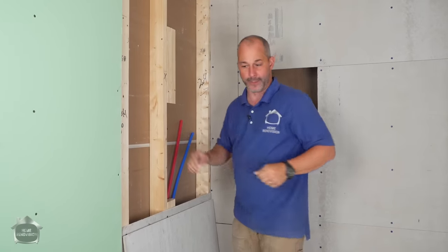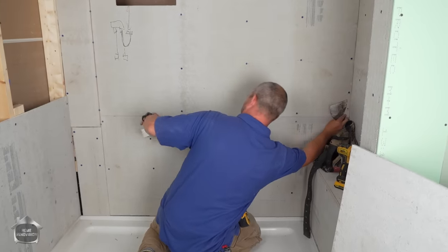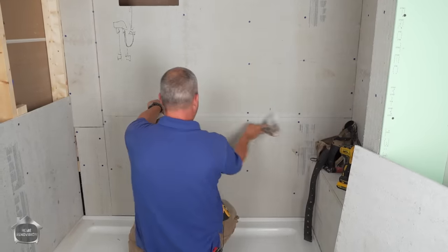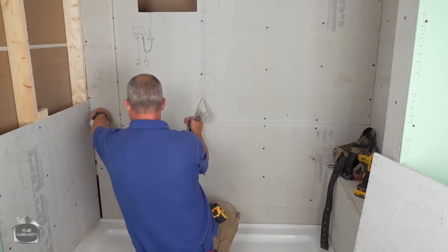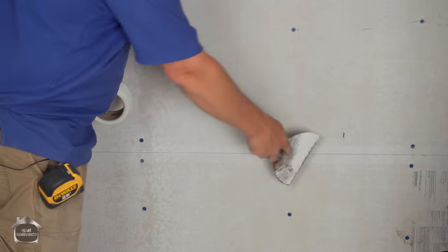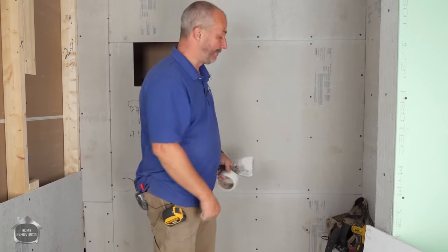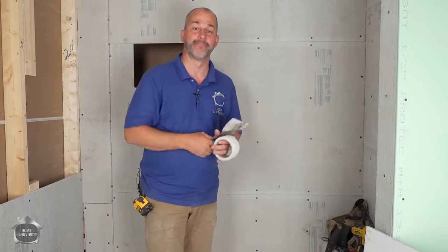This is where this gets interesting, right? Okay, well, we're just putting on our self-adhesive fiberglass mesh tape. Part of the process for dealing with this cement board, the product recommendation is that we use a little bit of quick set over top of that cement. Once it's dry, we can take out our Aqua Defense green membrane. It's the roll-on, and we'll just paint the shower before we tile.